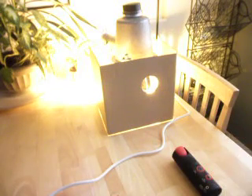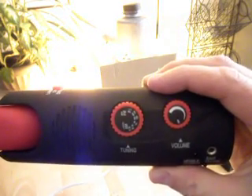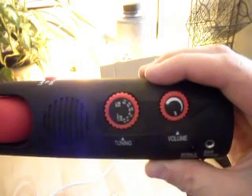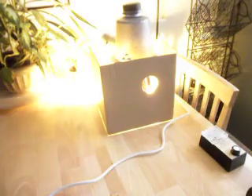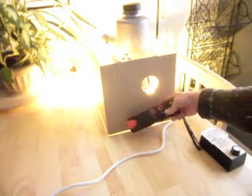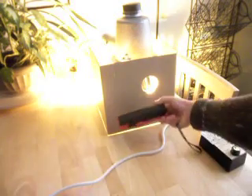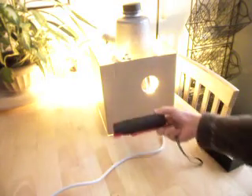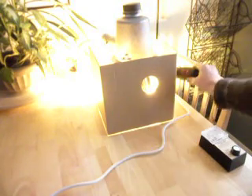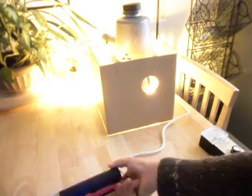So that's our tri-field testing done. Let's test it for wideband radio emissions with an AM radio. This particular AM radio is tuned into AM530, where there's static — we don't have a radio station. You can be tuned in anywhere on the AM band. We're going to scan the equipment and see what we find. There's a small radio field around the light bulb and around the top of the light, and that field is somewhat on the cable as well.